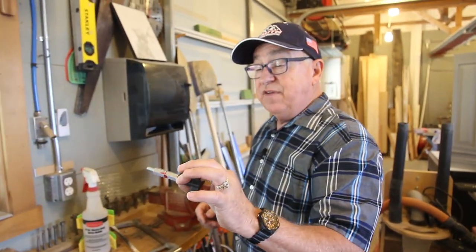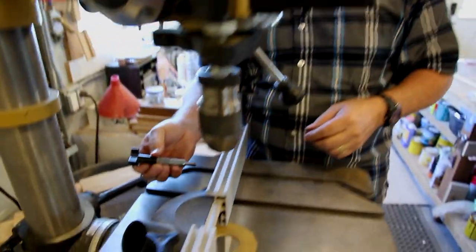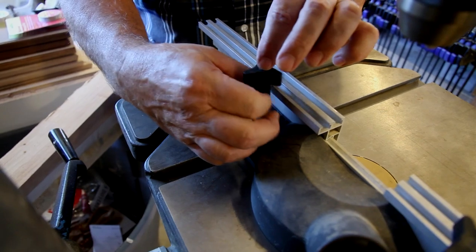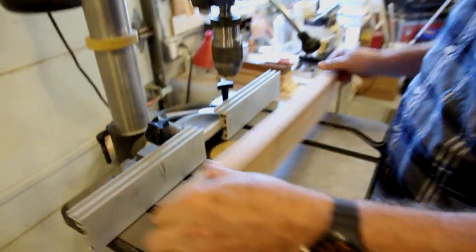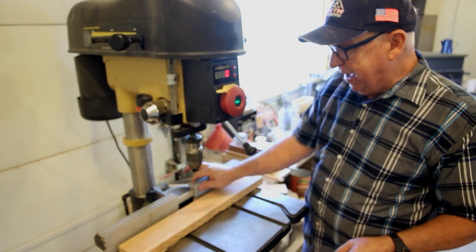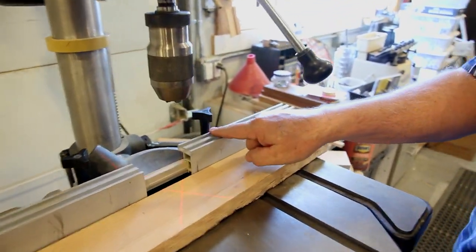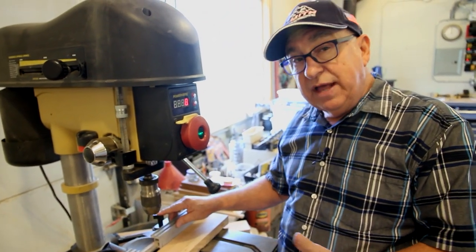Now that we've made a pair of these with the appropriate length sticking out of the bottom of the nut, locate them on the fence making sure the capture nut below is in line. Drop it in there and spin it in place — you can see it engaging right there. Leave that a little loose; we've already placed the one over here. Now you would put your board on here, adjust the fence to where you want it, and you can do this very easily across the top. You can reach these very easily and loosen them, move the fence — no problem. It's a great improvement. The only downside is that in certain positions the handle may come out over the top, which matters if you're doing jigs or fixtures. But that's so rare that this everyday convenience is more important.